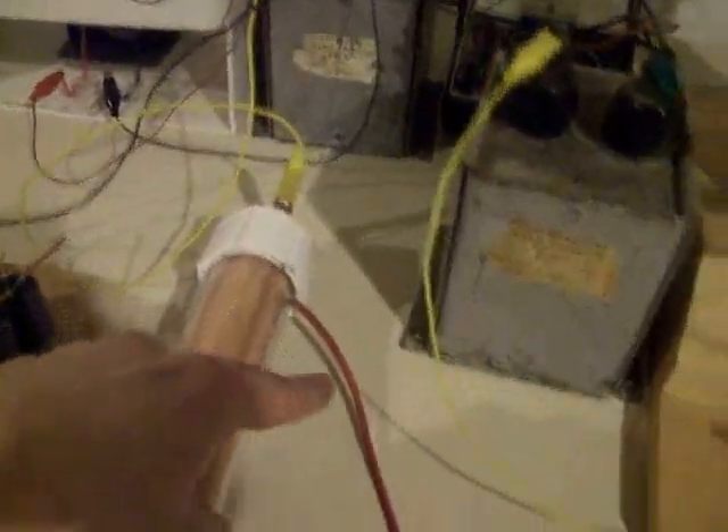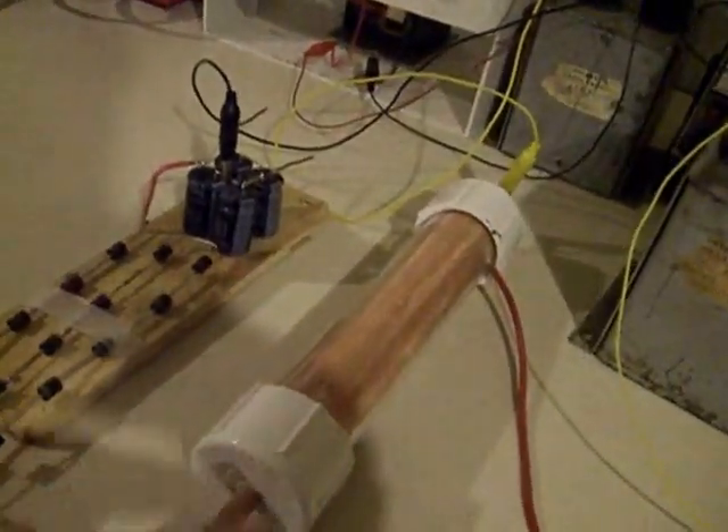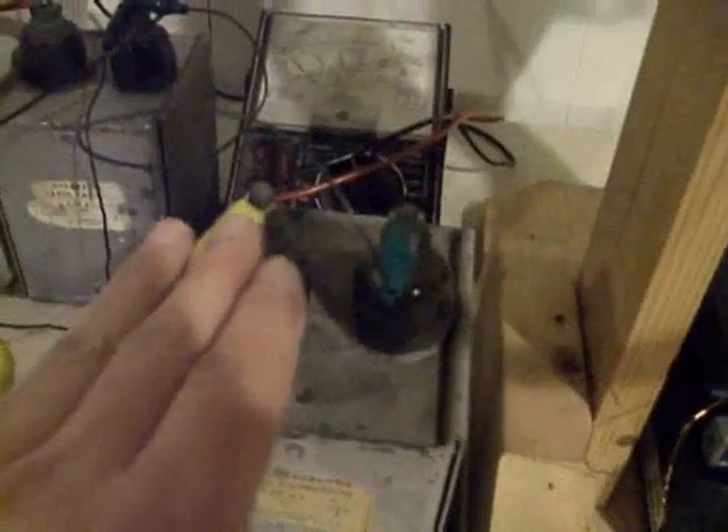So: high voltage positive, high voltage rod to grids, into the coil, out of the coil to the cap, and then back to ground. What's going to happen is, once it's charged up and once I let this chopstick out of the wheel there — using that to stop it — that switch right there is going to contact both switches. As soon as it does that, it's going to make contact to the low voltage source to allow that to jump the gap to the low voltage rod and back. The diodes will shut off, and the high voltage potential has nowhere to go except to the grids, which it'll do through the coil, back to ground, through positive on a cap, negative on a cap, back to the negative on the high voltage source. And so that's going to be the trigger.